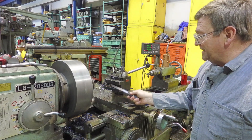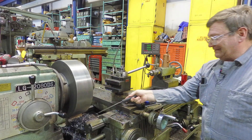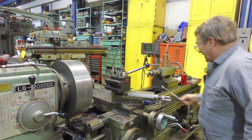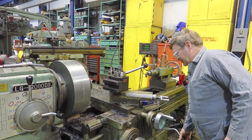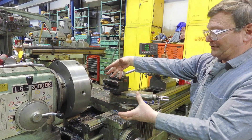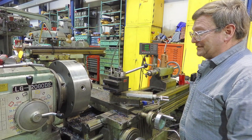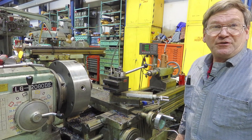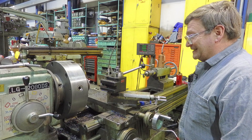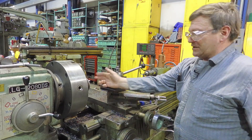You want to not be in the way of the chuck. If they happen to get in there and get caught up, it can be bad. That is a lot worse when those come around in the chuck. You'll get a ball sometimes that's just large. One of the things you want to do is stop — stop what you're doing if you can. Clean all that stuff out. Other times you're at the end of something, you let it run, you stay back away from where that ball could come out.